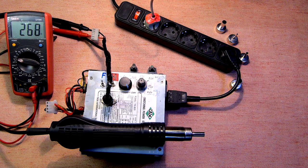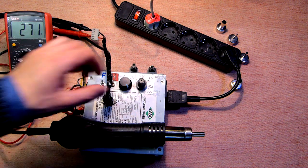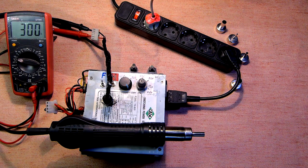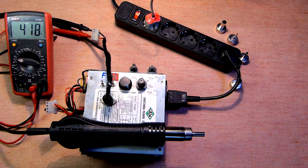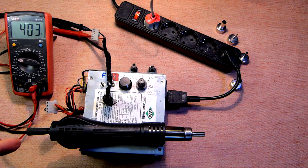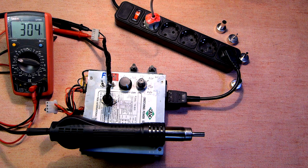If we wait one or two minutes, the temperature will reach a maximum of 290 to 292 degrees at the middle position. After two minutes it will be approximately 345 degrees. As to the maximum temperature, after approximately 10 minutes it increased up to 480–485 degrees. As soon as we turn this off, the heating also turns off automatically. But don't use that method — let the temperature decrease, and approximately in 5 minutes turn this device off.